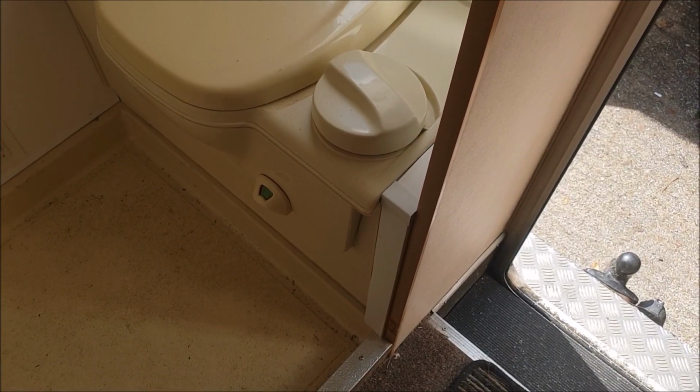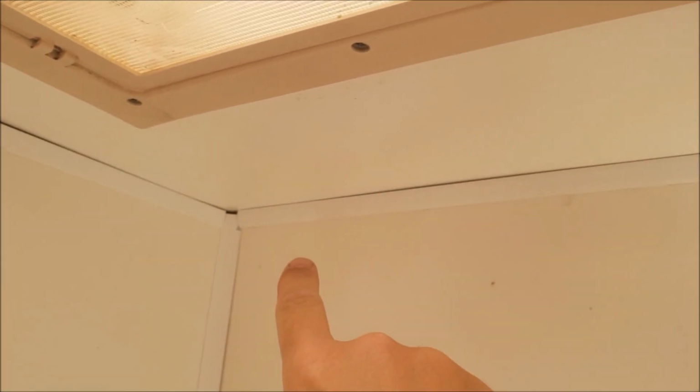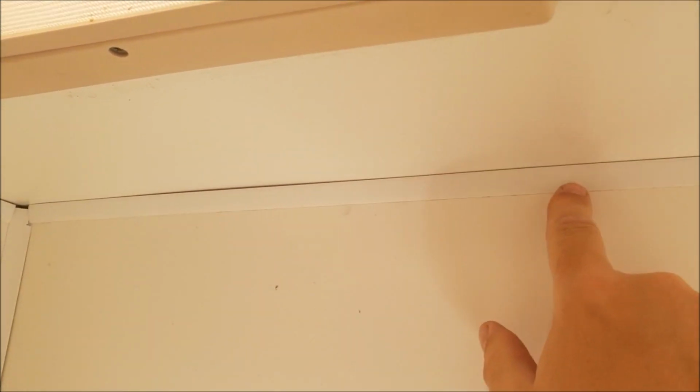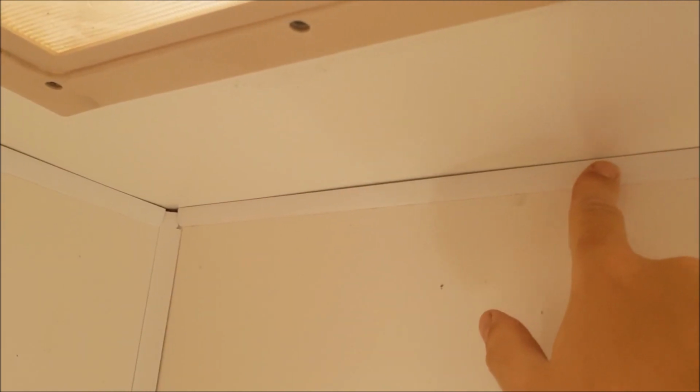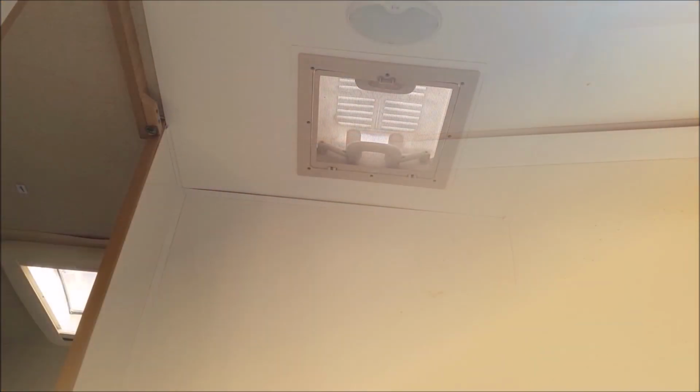Anyway, now that's done, we can start the silicone sealant, and the thing to do is I'm going to clean it down a little bit, and then I am going to tape the joints and just apply the silicone in a normal way, smoothing off with a bit of water. And yeah, that should hide up a lot of these gaps.